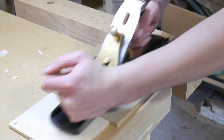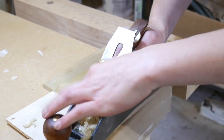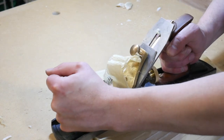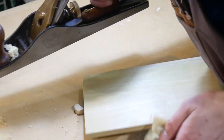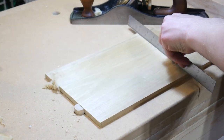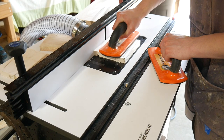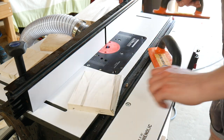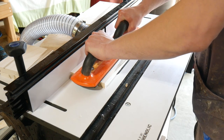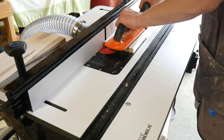Here I'm using this as the secondary wood — I actually don't know what kind of wood this is, I had it laying around, so if any of you know what it is leave a comment. It's relatively soft and kind of has the green of poplar but I don't think it is poplar. I flattened this piece and planed it down to a quarter of an inch for the bottom. Then I get the box parts and put in a corresponding quarter-inch groove on the router table, which leaves a nice clean result — as opposed to using a ripping blade on the table saw — and you can also do it in one pass, which is a big advantage.